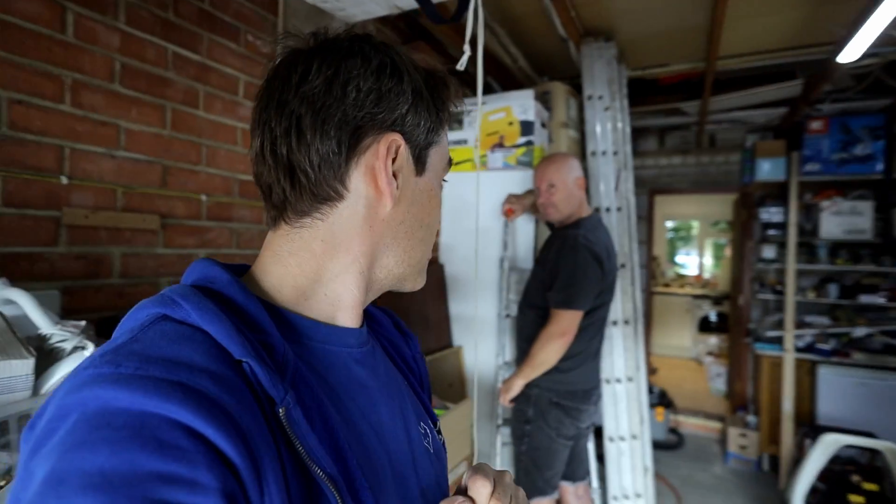This is achieved when installed in a certain way: no third-party controls, hopefully no buffers, no zoning, and fully weather-compensated. As soon as you try to do clever things — zone the system, put in third-party controls — you're going to kill the efficiency and end up with a pretty expensive and probably unreliable system. The electrician is about to finish his work, so we're very close to firing it up and testing it.